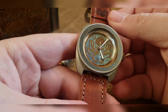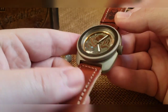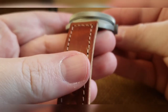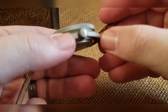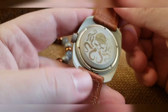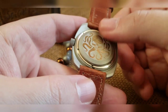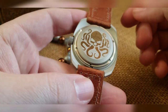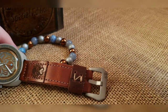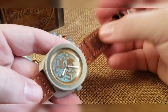Painted blue and then baked, this is in a bead blasted 710 case with a bead blasted coin bezel. We also have our bead blasted and Kraken-engraved crown, and a bead blasted and engraved Kraken case back. This is milled down — you take a stock case back and mill it all the way down. The buckle is also done the same way, and then this is on a two-piece Kraken-branded Horween strap.